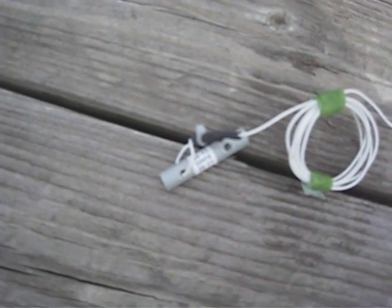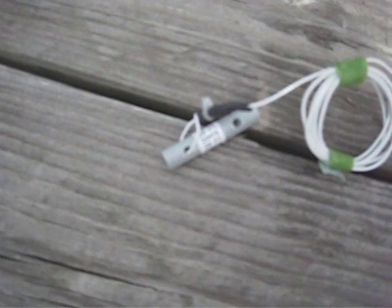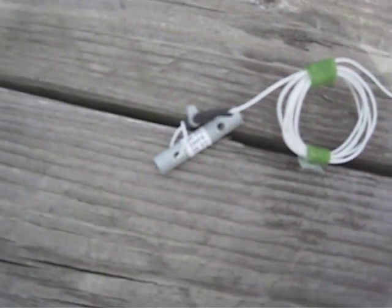The end insulator is a piece of fiberglass — 3/8-inch fiberglass. I got it at Tractor Supply. You can get 3 feet for only about $1.49. Cut them down, drill holes in it. Now they are fiberglass, so when you make these, if you have rubber gloves put them on. The fiberglass is itchy, and the fiberglass is going to be flying so just be aware of that.